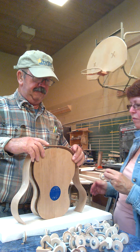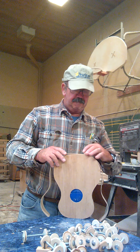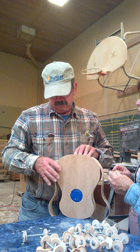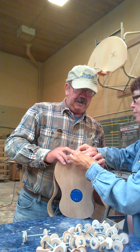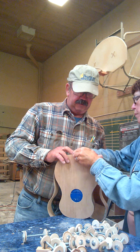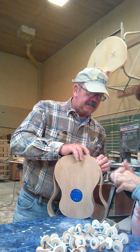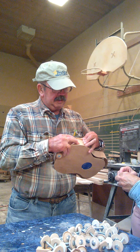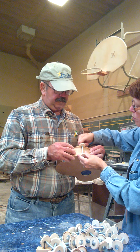Now we go a little bit different than what a lot of people do. I actually build my top and bottom, assemble them, and then apply the sides. So the kerfing is actually built right into the top and bottom. We've got a nice glue surface all around. Set that down, being careful not to get glue on what will be the finished surface.